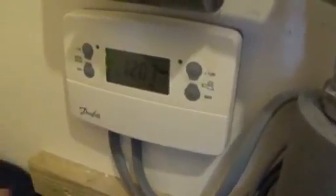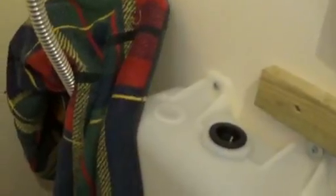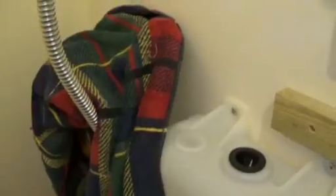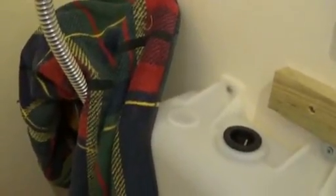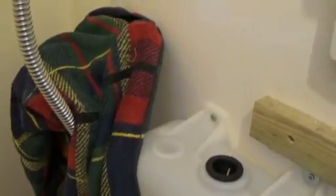A quick tip: if you have some old towels, cover up the plumbing before you start drilling. You don't want dust and debris falling into valves and pipes. I keep towels handy during plumbing work — if you get a leak, it's much better to soak into a towel than go through floorboard gaps into the ceiling below. Pressure relief valves in particular are very fussy about dirt, which can stop the seat from sitting properly.